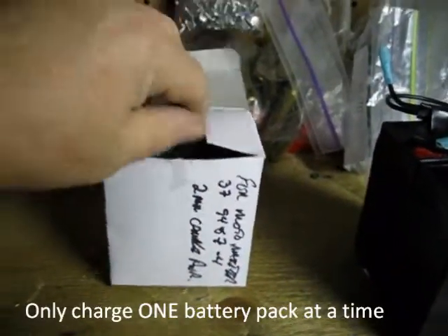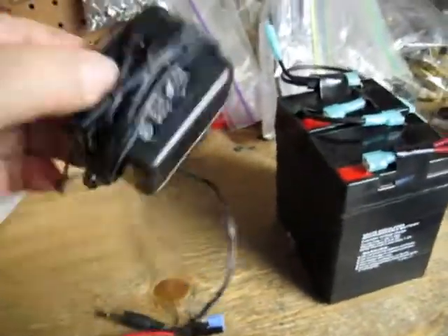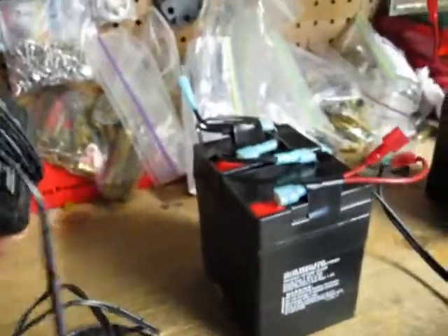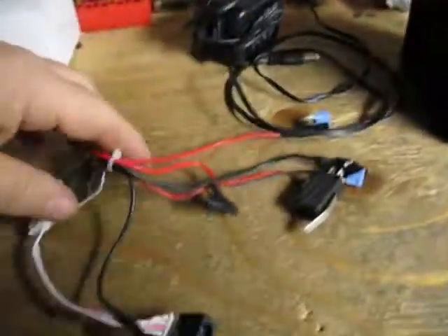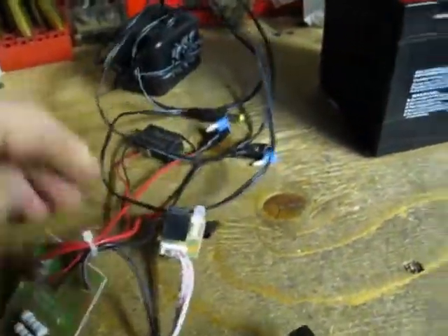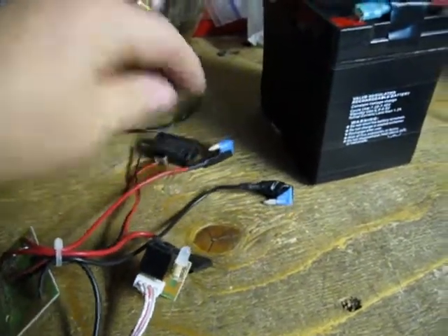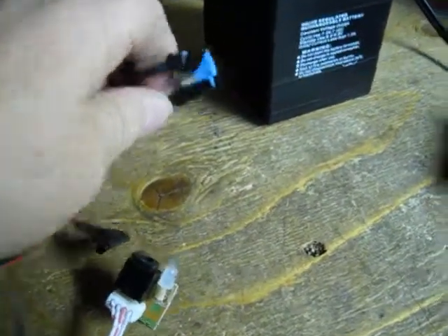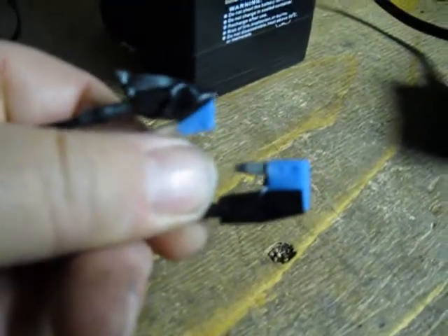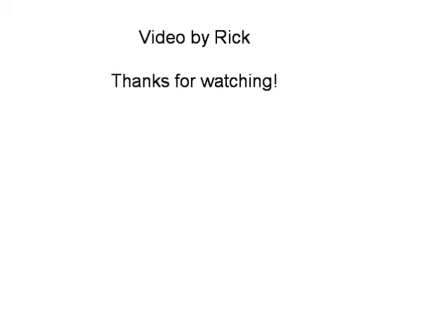When you buy new equipment — and we're only dealing with new here, not used. This is the charger for it: it's a 12 volt, 400 milliamp charger. We've got the guts from inside the light — there's the switch to turn the light on and off, and the two leads that went to the battery. I've got them modified: I put a fuse in each side and taped up where the fuse went in. And that's what I'm going to connect up to the wiring with.